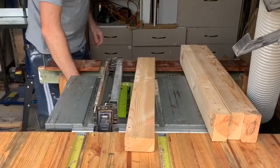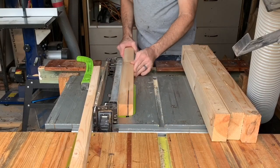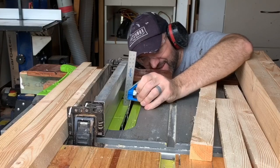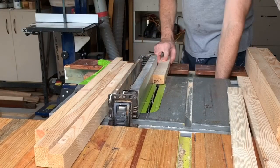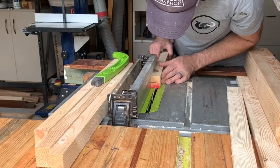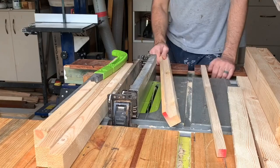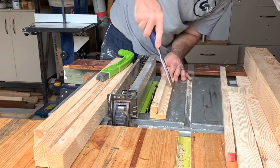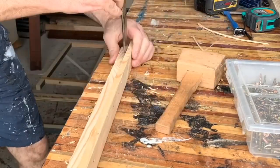We need more timber. So I've got these four bits of pine off a pallet, and they are dead square for pallets, which is pretty good. I'm going to rip those down and make my shelving for the midsection of this unit. I'm going to use the table saw, cut them to size, and then cut a rebate. That's going to save me doing heaps of extra capping, so this piece will do both the holding of the shelf and capping it, so it looks nice and pretty from the front. I've had a few cracks at doing this technique but never been able to get the table saw perfect so it doesn't leave a little strip in the joint, but it's just a quick clean out with the chisel, a few love taps, and a bit of a rub of sandpaper, and it's a beautiful piece of timber.